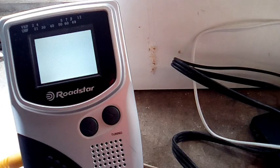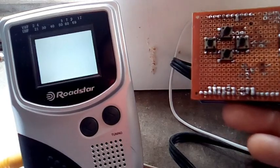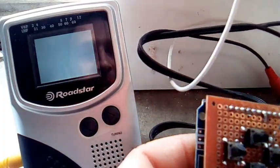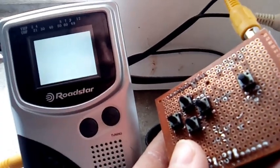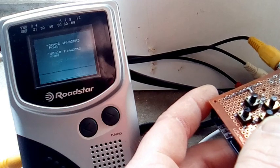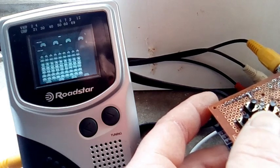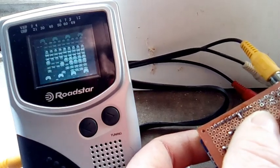Now we start with the first video test to see if it works. I've got the Arduino and the shield here. I connect the video into the little port on the small TV, connect a USB battery to the Arduino, and we should get a picture on screen. We got a picture all right, but it's bouncing all over — it looks like it's not syncing properly. It's Space Invaders though, so it's definitely working; it's just that the TV doesn't seem to be synchronizing properly — it's rolling.